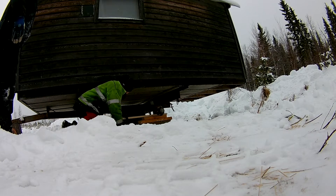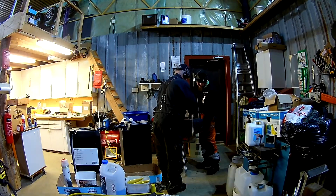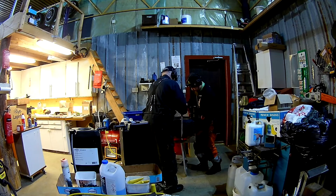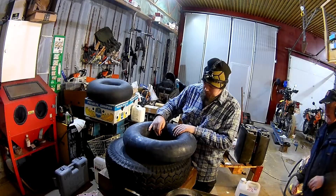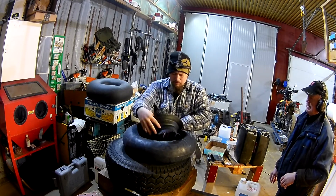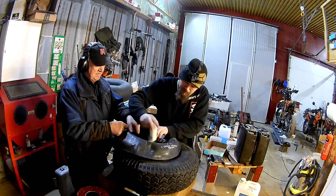The nut was loosened before jacking it up, then we put a few wooden pieces under as a safety. It has a split rim design, and the tire has probably been on there for 40 years — it was used to hold timber behind an old tractor back in the day. We used some C-clamps to force the rubber down and get it loosened from the split rim. It has a heavy-duty inner liner protector for the tube — you don't see things that beefy normally these days.